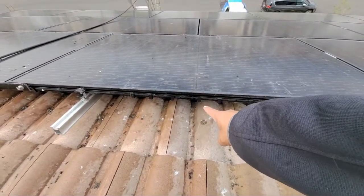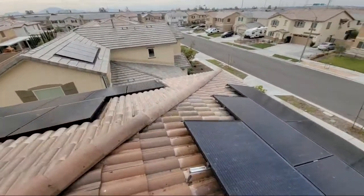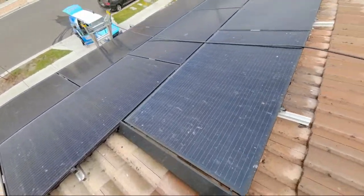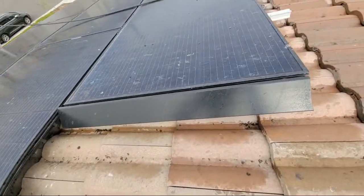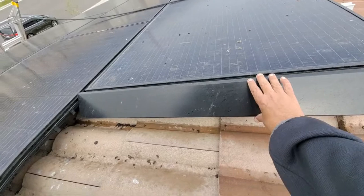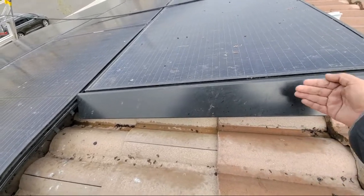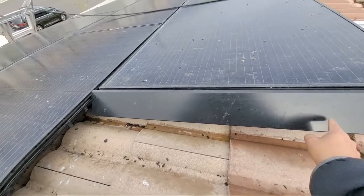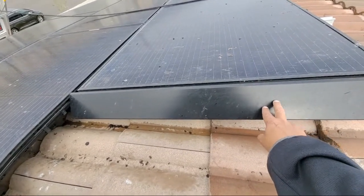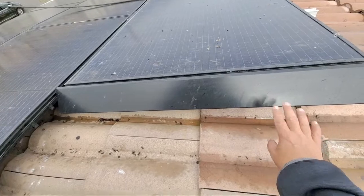We're going to be using the nylon clips here on this one, and then this has a fascia board, and on the fascia board we're going to use sheet metal screws. So let me show you here. Here you can't get underneath the panel from right here. So this is a cosmetic piece, okay, which is all the way in the front. So we're going to use sheet metal screws with the 6-inch basically to come down here, and then use the fascia board as a secure point, okay. And this is the only time we use sheet metal screws for this, and it's going to look real nice after it is all said and done.